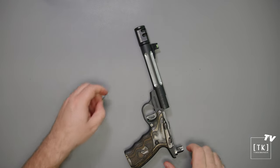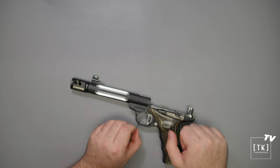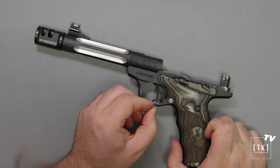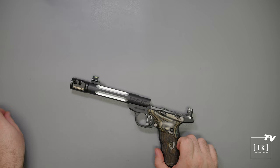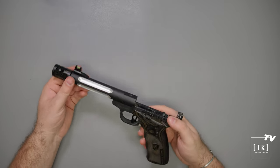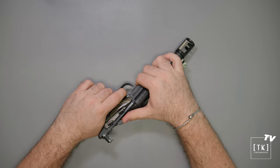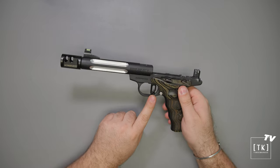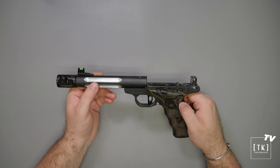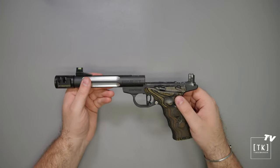It is beginning to fall — it just needed about one turn back, but it's just on the edge of reliability. So I'll take it back another half turn or so, accounting for uncontrollable factors like hot day or cold day, so we know it's still going to run. Now that we've adjusted the over-travel to be as clean as possible — the shortest overall trigger throw while maintaining reliability — we can go ahead and let that Loctite cure for about 24 hours.